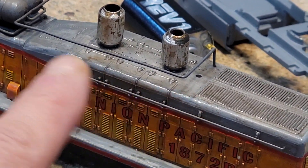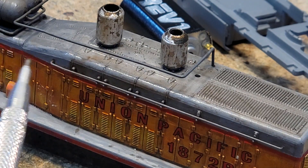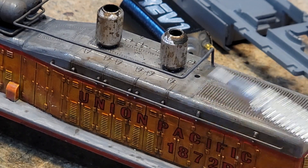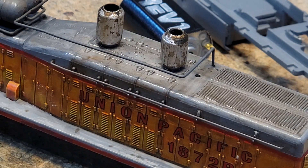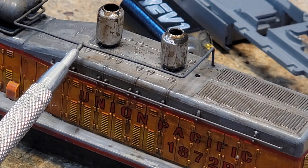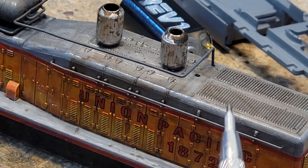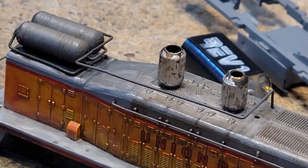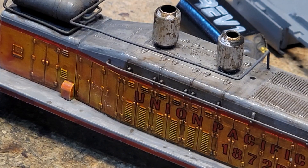This airline that goes around here — on the prototype and in the photos, there are some things that hold it up. I have thought about this and worked on it a bit, and I have determined one thing. Because this air tank line is a wire, if I put those two brackets in there, they're going to be the first things that break off. They're just going to break off and go away, and then it's going to turn to crap. As long as I don't do that, everything is good.